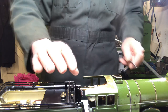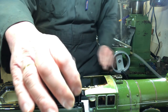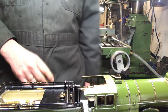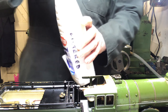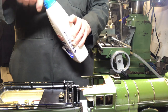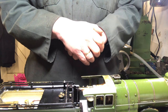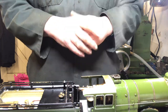So now she's stopping. If we put it in reverse, which normally just means moving the engine back one turn or so, you can see the water level has gone down quite substantially in the tender and therefore it's necessary to refill. Pour a little in quite carefully. If you do let the water fall too far, it starts to suck air into the system and then of course it can't pump. But more importantly, even if you do fill it with water, it's necessary to reprime the system — that means open the bypass, pump some water through to get rid of all the air, then close the bypass and it should carry on working.